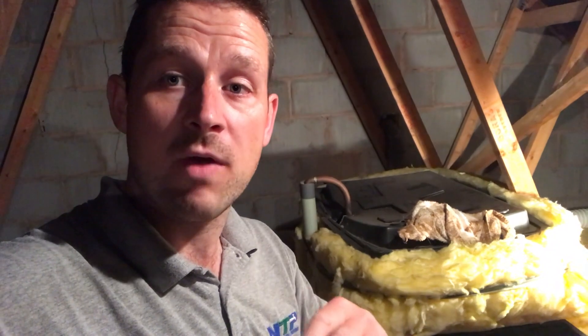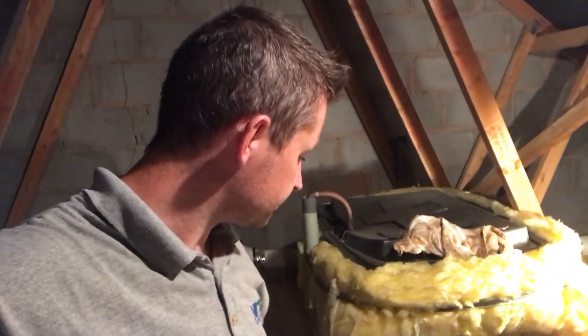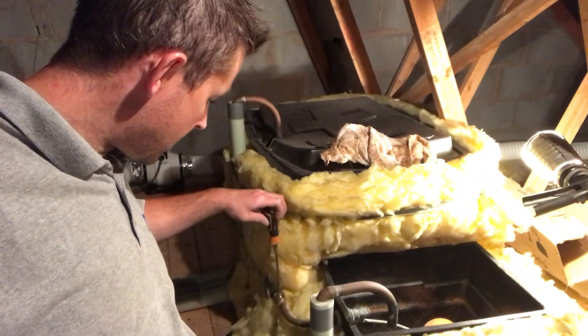We've made all our connections downstairs and we're ready to refill the central heating system. Before we do that, double-check that all the bleed valves on all the radiators — downstairs, upstairs, everywhere — are turned off. Also double-check your connections on the radiator and any adjustments made to the central heating system. Key point: I've turned the drain-off valve off but I've left the hose connected. The reason is that once we fill up we've got to work quickly, and if there are any leaks or anything we're not happy with, we can simply run up here, turn the isolation valve off, open the drain-off valve downstairs, and that way we'll minimise any problems. It's unlikely, but it's always best to err on the side of caution.